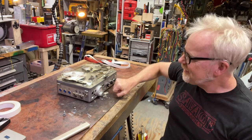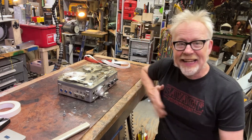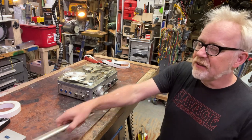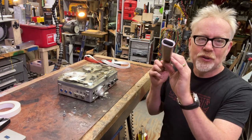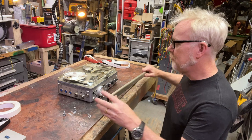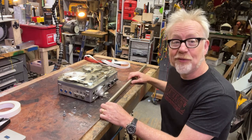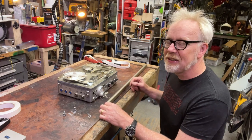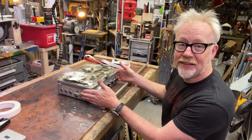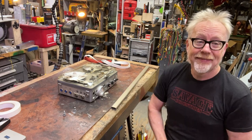It needs a handle, not least because you can actually prop it up on the handle, but also you can carry it around. And the real Nagra handles are expensive and rare, but they utilize an oval piece of aluminum here. And after a long search, that's also part of the video that's in the description, I found the piece that I needed. So I'm going to manufacture a handle for this Nagra, and it's really effectively manufacturing two pieces, the two arms that sit on either side of this, and then an attachment method for connecting them to this really robustly. And that's it. That's exactly what I'm making.